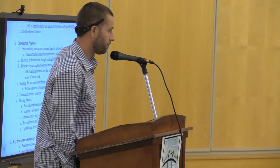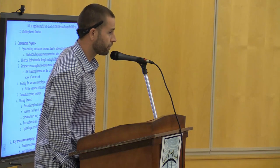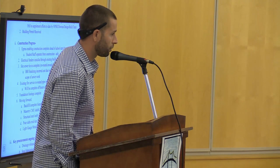The existing fire service has been relocated. We have not tied into it yet. The chlorination report is pending as of my knowledge right now. It could be that it passed. We have a test to do for the Newport Fire Department that we are doing off hours prior to tying in the new fire service, but currently there is fire service active to the building, the sprinkler is on, and we have proceeded with construction in a manner that the NFD has allowed us to in terms of the live fire service under the footings.